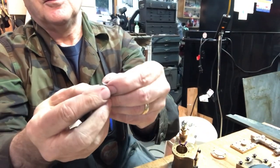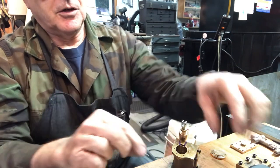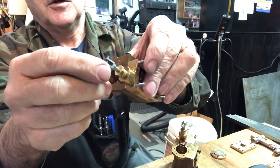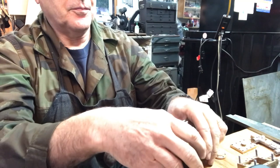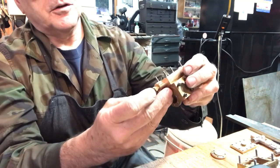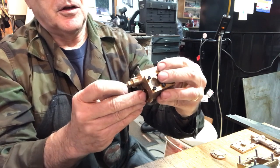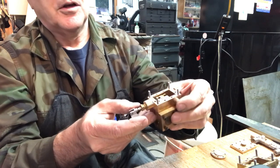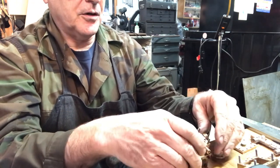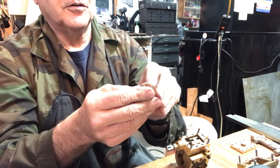This is a short video this week. I'll show you the little progress we did. These are how the little homemade quarter-inch shoulder bolts came out — really nice — and they go inside the clevices. Here's the right-hand side clevis, pretty pleased about that. Also, these are the remade valve spindles. They came out a lot better — they're a lot straighter than the ones I warped before. Made them a little bit longer, and of course using the high-quality 303 stainless from McMaster Carr.